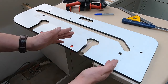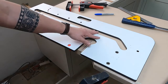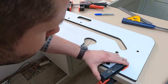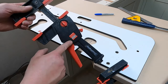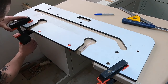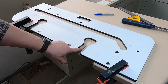Bring the jig over and line it up with the centre mark. If you haven't got a centre mark, you can measure to the centre with a tape measure - you want to be in the middle, not offset. Then put decent clamps on there to hold it down, bearing in mind the router base size so you don't bash into the clamps while routing. Put as many clamps as you can on - you don't want this jig slipping.